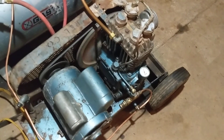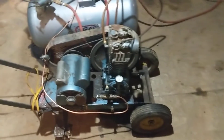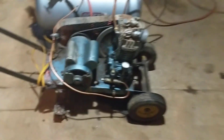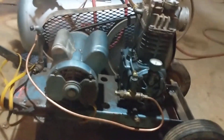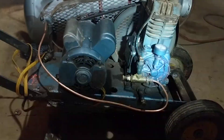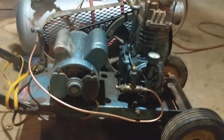At home I have another 210 unit mounted on a 60-gallon tank, though I don't think that tank is any good. The other 210 unit doesn't have unloaders on the suction side, so what I'm going to do is grab that compressor, mount it on this rig here while I get a rebuild kit for this one and rebuild it. I'll have two going, and then once I get this one rebuilt I'll take the other one off and probably rebuild that too. Just switched off — that was a few-minute run.